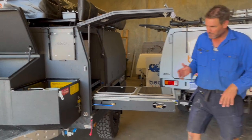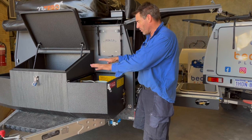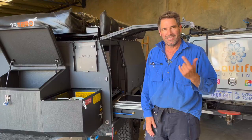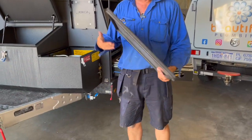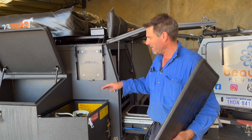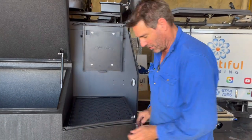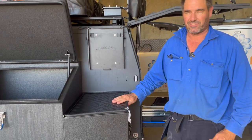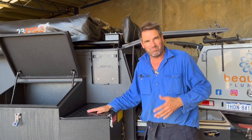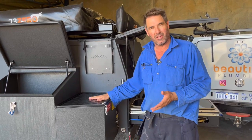That's probably why they don't put the regulator on there. Phil wanted the dual hot water system on this side, so it's closer to the kitchen sink so you're not running cold water for a little bit. The way it sits here, you wouldn't be allowed to use it because this hot water unit would be in the ignition source zone. So that's why we had to stick a lid on it. I just made a lid — added some 3mm checker plate with some pinch weld on it, and set up some black aluminium from Bunnings around here. All you've got to do is wedge it in, push it in, it locks nicely, and you've got one of those toggle latches that locks it out. So there's no way the gas can get up. The vents are in the bottom, so all this is not in the explosion zone anymore. You can use the dual hot water system safely without it going in that ignition zone.